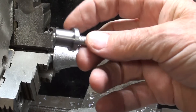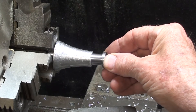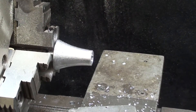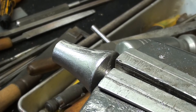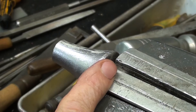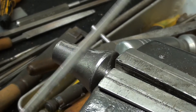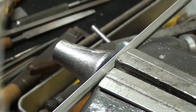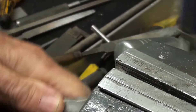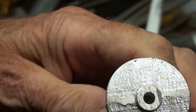I'm not going to make another one of these bushings — that should press in there quite nicely. It's ready to take out. At long last I'll cut the stem — the handle — off. Make sure you don't do that until you're absolutely sure you're done with all the other operations, and don't take it out of the lathe until you're done. Now you can see the hole I drilled with the 3/16 — that'll make sense shortly.